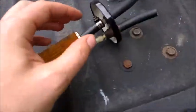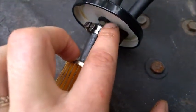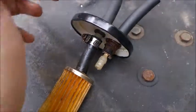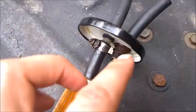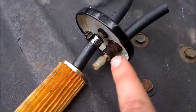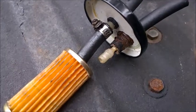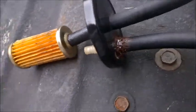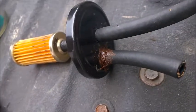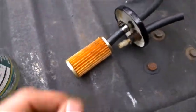This plastic insert is there to make a good tight seal — to swell the hose right here so that it fits nice and tight in the hole I drilled in the lid. Same thing here, this is poking through hopefully making it widen and fit nice and tight. This hole actually sort of ripped out a little bit while I was drilling it, so I tried to put some gasket maker to seal it — hopefully it holds.